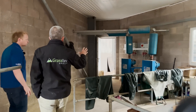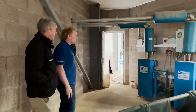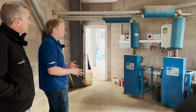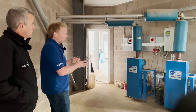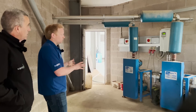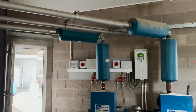Two vacuum pumps here for redundancy — 72 units. Ironically one will run it, but we wanted redundancy because we're milking such a large number of cows. One will actually run and milk them perfectly fine, so we run them both together so that one's not taking more load than the other, and then if something did happen we can switch over. There hasn't been, but that's the redundancy.